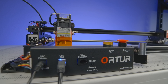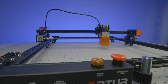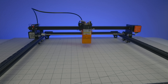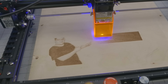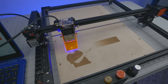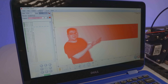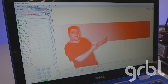This is the Laser Master II Pro from Ortur, a brand that, in the past couple of years, has become all but synonymous with a variety of hobbyist-grade CNC laser gadgetry. This latest offering spans an engraving area of 400x400mm, features 32-bit motor control, and a 5.5W fixed focus laser with a 12-bit pulse-width controller, making it possible to vary the output by as little as 1 tenth of 1%. In other words, smooth gradients. The operating software can be just about anything capable of streaming G-code over USB. Here I'm using Laser GRBL, which is a type of firmware written for the Arduino controller.